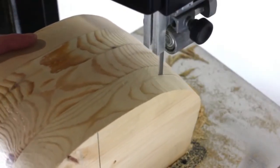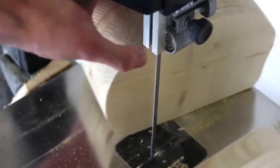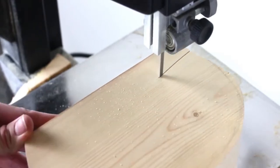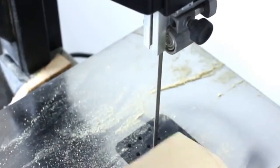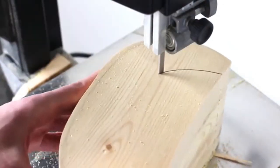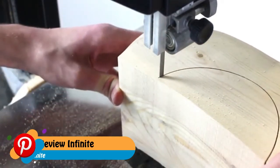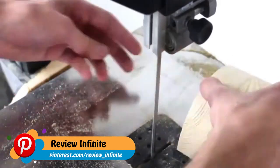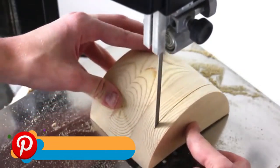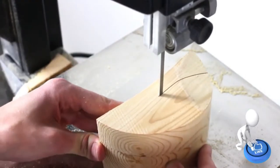Once you have cut out the box, the next step is to cut a flat piece off the back. Set this piece aside, as you will need to be gluing it back on at a later point in time. After that, it's time to cut out your drawer. For mine, I chose to slice off the bottom of the slab in order to have easy access to cutting out my drawer. To make your drawer, cut out a solid piece from the center of the block. Perfect! Next, set aside the rest of your bandsaw box and cut off flat pieces from both the front and back of your drawer. Finally, cut the center out of the drawer to allow for room to put stuff.